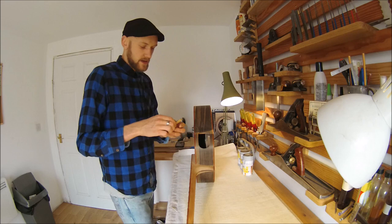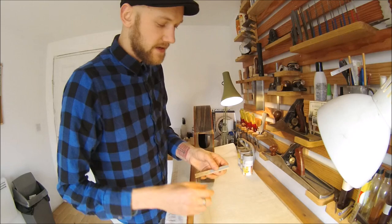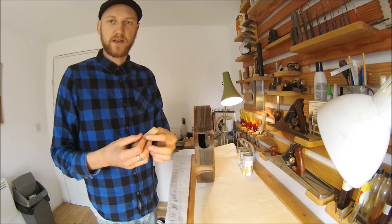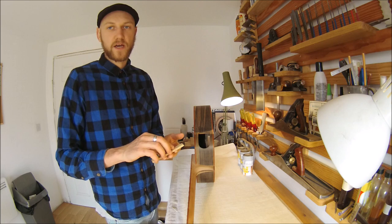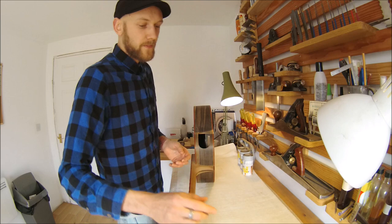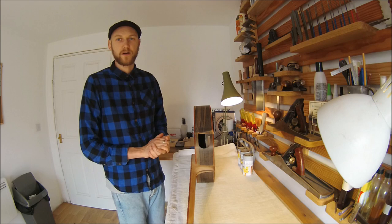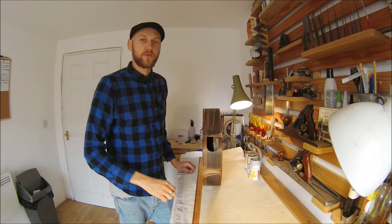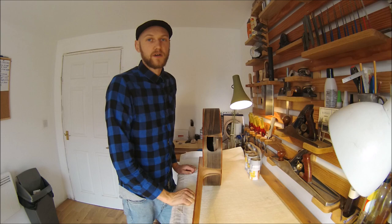I've also made a couple of sanding sticks. One is a small eight-millimetre piece of spruce, and another is flatter with the edges angled back — that's handy for truing up the face of a dovetail joint, for both the male and female part, fine-tuning the joint so it fits perfectly. That's pretty much everything for today's video. All the abrasives I've mentioned will be linked in the description below. I hope you found it informative — if you did, please give it a thumbs up and subscribe to the channel, and I'll catch you in the next video.